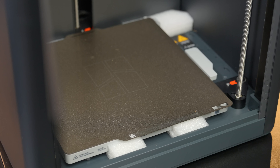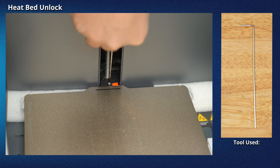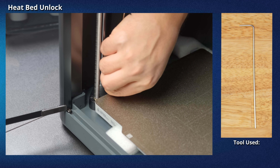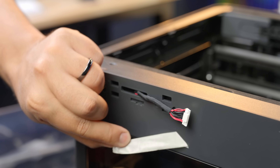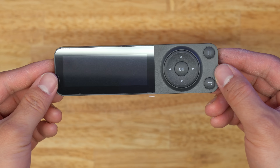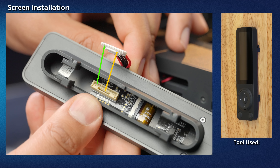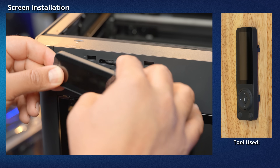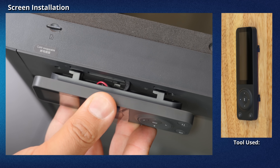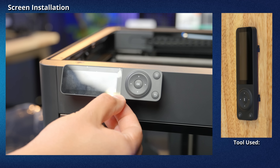Remove the foam piece from the excess chute and the piece of tape near the air filter. There are foam pieces underneath the heat bed — these will be removed later. The heat bed is secured to the printer by three screws with orange indicators. Remove these three screws using the Allen Key H2 tool to unlock the heat bed. Remove the tape covering the SD card and the tape holding the LCD cable in place. Next, we will install the screen. Insert the LCD cable into the port on the screen, making sure the cable notch lines up with the port in the correct orientation. The hook on the back of the screen should be pointing to the left. Gently bend the LCD cable towards the opening on the back of the screen, then insert the screen into the slot in the printer and lock it by pushing it to the left.